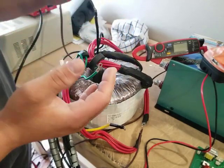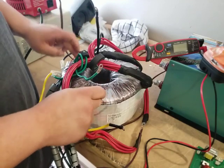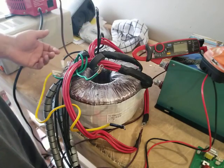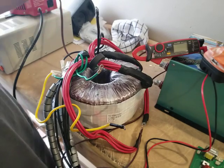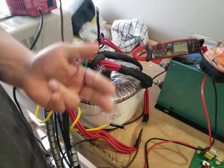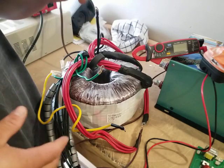They are not different voltages. They are basically the same. There's maybe an extra winding or two that might bump it up or bring it down a little bit between the two, but this is a twin winding transformer. It's simple and it doesn't have to be complicated. The argument I'm getting into right now is that because the voltages are different, it's going to be a different reading — no. I tested it myself. I turned on the items that I have in the house myself, I know approximately how much they use, and it was right in line with what the LCD screen was reading. There's no tricks.